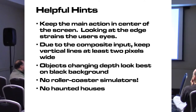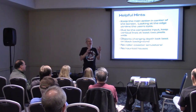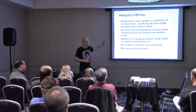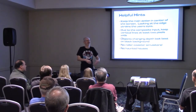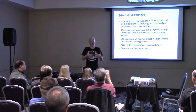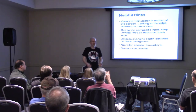Some things I found out while doing this: it's kind of hard to see the edges of the VR goggles, so keep the action in the center. A Google Cardboard headset would detect head motion and move with you — of course this one doesn't do that, so we need to keep the action in the center. It is driven by composite video, so the screen is sharper than what you saw through the goggles. You have to think about the fuzziness and colors next to each other like we used to deal with on TVs. Things changing depth on a black background seem a lot easier for the eye to see. Once you have different color pixels on top of each other, the enemies can get a little blurry — but when they have some separation, the depth is really clear.